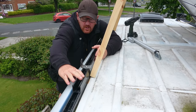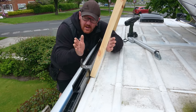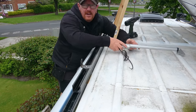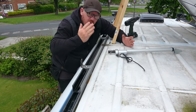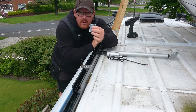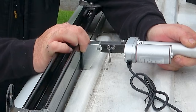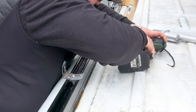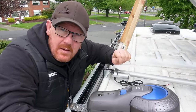So we've got the unistrut up on top. Now we can get the actuators up there and get them installed. As you can see, we've put another piece of unistrut on both sides and basically just unistrut-ed the unistrut to the unistrut, giving us an extra 31mm of height. The plan is right in the centre of the actual solar unit - which is going to be the heaviest point - we're going to put the actuator. We have these brackets which are going to bolt into the extra unistrut, which will give us enough room to slide it on and make it go up and down.